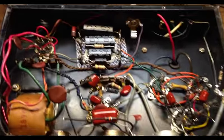And I think what I might do actually is disconnect these and just go with something a little more standard in an effort to see if that is part of the motorboating problem. Now, I know everything else I've done is fairly standard. Now, this I've actually gotten rid of now, and I've come over here, and I think it was like 100 ohm. I may put it back up to a meg, but move this over to here instead. But yeah, I've actually got everything fairly standard. I just don't understand where the motorboating is coming in quite yet. I mean, we'll eventually track it down, but at the moment I'm kind of stumped.